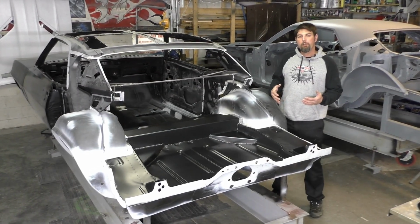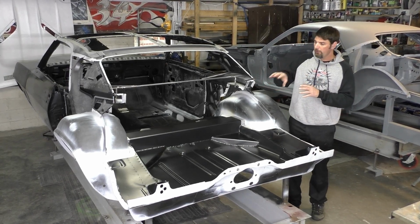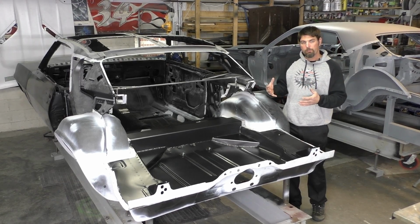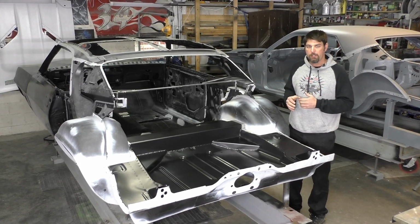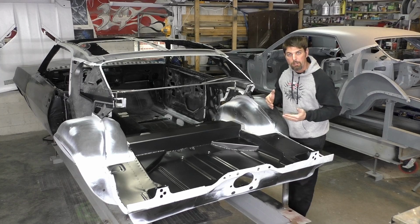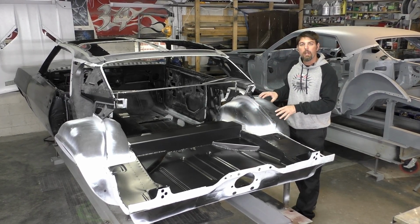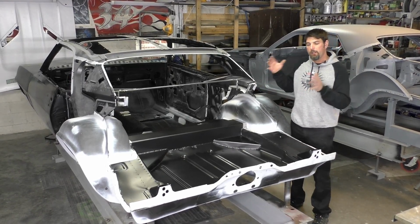All right, we're gonna wrap up our video on the 69 Firebird Quadralink rear suspension install from DSE. This could be a part 1 video. As you could see, we just did the portion of the car in this video. I put the mini tubs back in. You can see everything's fit up really good. Nothing's welded yet because we still might have to move these wheel houses up or down depending on how the quarter sets. That's going to be the next video.